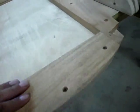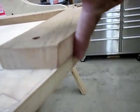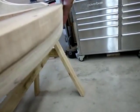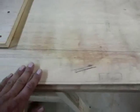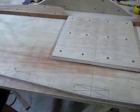If you look at the angle from the side, you can see that I beveled this at 10 degrees to match the transom. I still need to pick up another piece of mahogany to finish this and frame five and a half, but we're making darn good progress.